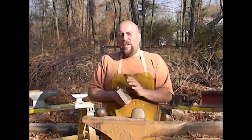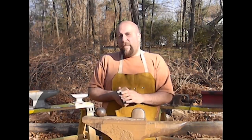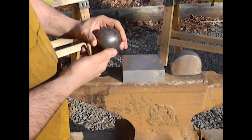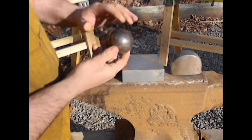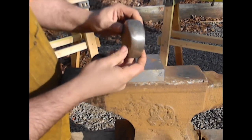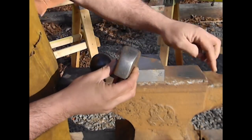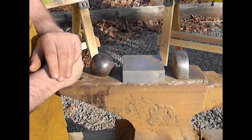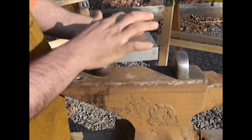If you can't put your hands on a decent anvil, go to your local scrapyard. You can find a block of steel that can serve you very well as an anvil until you get the real thing. You can find all different sorts and shapes of metal in a scrapyard. This ball is solid steel, and when I do get an anvil my intention is to weld a post that will fit in the hardy hole so I can use this for dishing out copper ladles and things like that. I also found an old auto body dolly with a nice rounded taper — almost the same circumference as the starting point of my horn. These three pieces of steel cost me less than $5 at the scrapyard. If you take this and put it inside a vise, you have a pretty decent pounding surface.